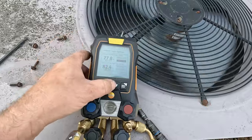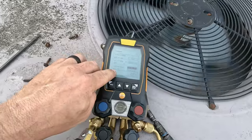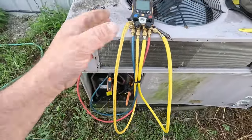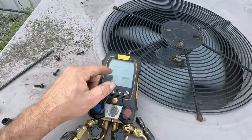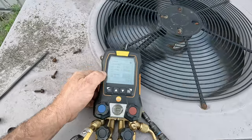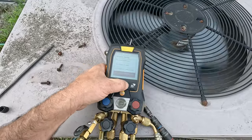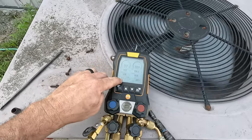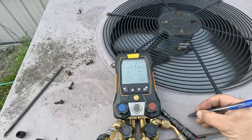So what we did is told the gauges that I wanted to do superheat. Superheat target is 14 degrees. We can literally have this thing charge itself — if it was low, I could put my wireless solenoid on there and actually charge it. So what we're going to do is recover some of this into a tank. Right now it shows 0.1 superheat, but we do need 14 degrees superheat. We can escape back out of here — that was charging by superheat. We've got charging by subcooling, and then there's recovery. So we're back to regular refrigerant charge. We know we are overcharged. Subcooling is at 26 and we had pretty much zero on superheat.